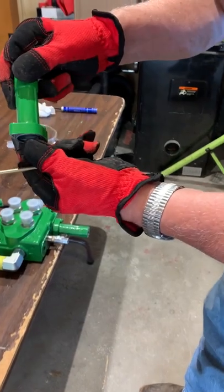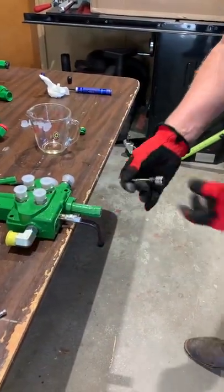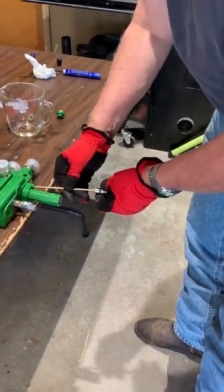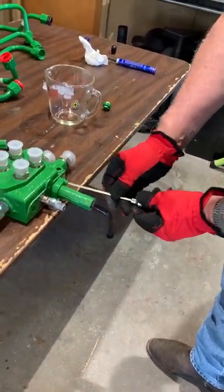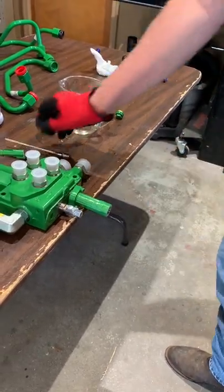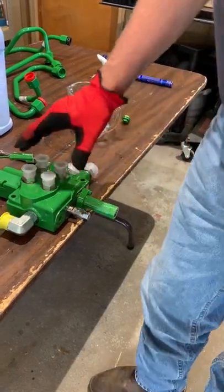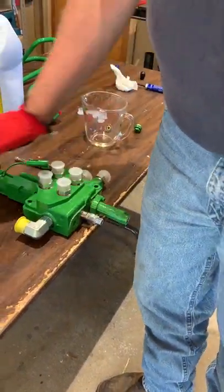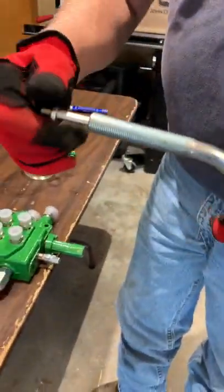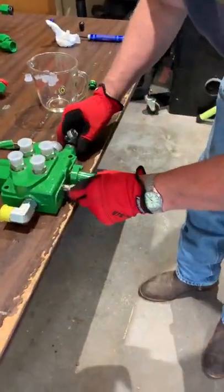The cap screws that hold this on to the valve body — there's one here — this is a four-millimeter hex drive and you can just take those out like this, because I have them loose. What I'm going to do is try to put my cables on before I mount this box to make it a little easier. This is the end that goes to this — now there's a little pin in here holding this yoke on.